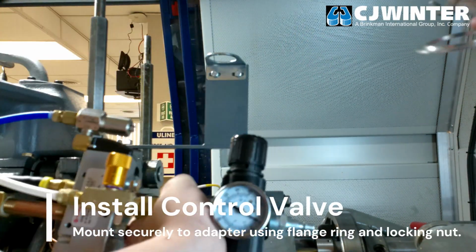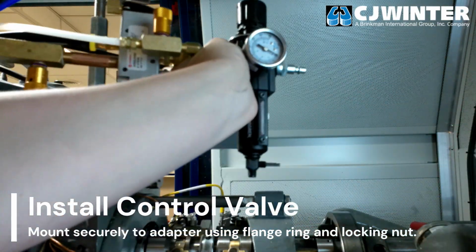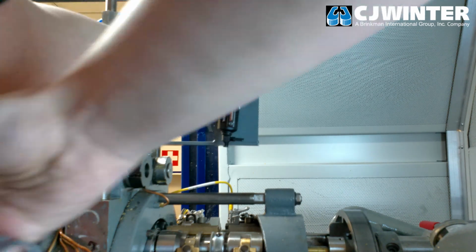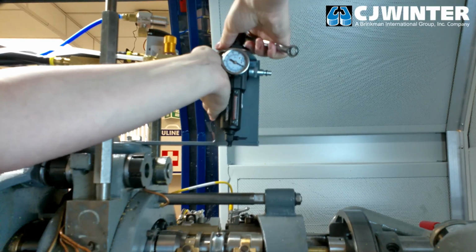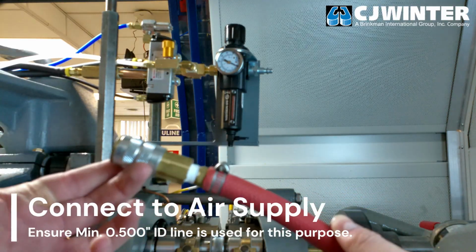adapter. Install the metal flat washer provided with the kit onto the upper body of the control valve assembly with the upset face facing upwards. Then, insert the upper body of the control valve from below into the adapter. Secure it from the top with the provided flange nut, and verify that it is snug and immobile. Once the pneumatics package has been installed, connect it to the machine's air supply.